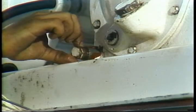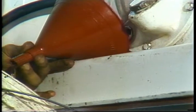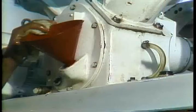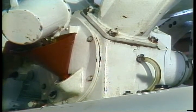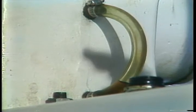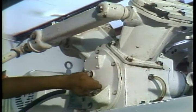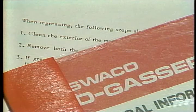Every month or so, depending on usage, you need to change the oil. To do that, unscrew the drain plug, let the oil drain out, screw the plug back in, unscrew the filler nut, and put in SAE 30 or 40 non-detergent oil. Check the oil level sight gauge — it should be about a third full. While you're looking at the motor, examine all the electrical wiring for any physical damage; any worn or damaged wire should be replaced. Every six months or so the electric motor should be greased — see your manual for details.